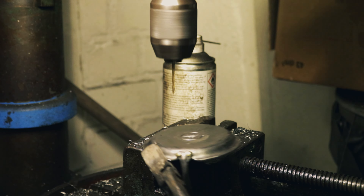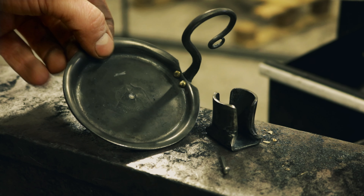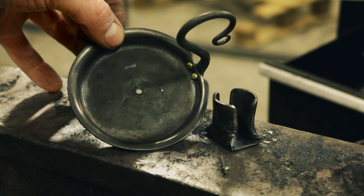You're using a round rivet, but here's the problem: round rivets can spin and make what they hold spin too. We could use a square rivet, but as in this case, it's not always possible to punch a square hole. At times we have no choice but drilling round holes.